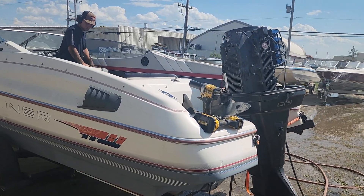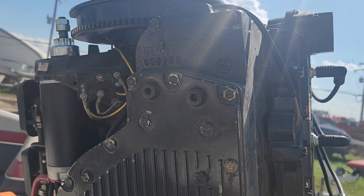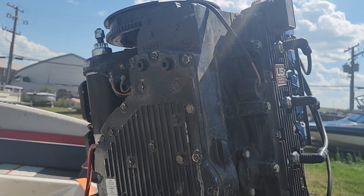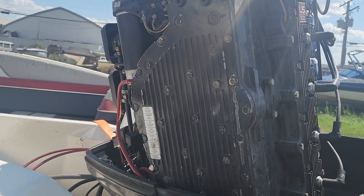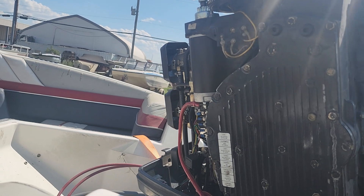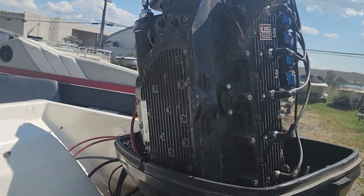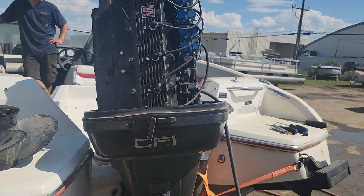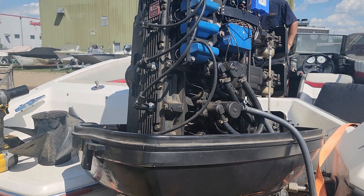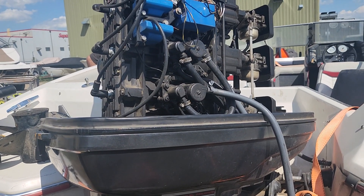One thing we did note when we originally started this engine is that water was leaking out through the top of the exhaust plates, which typically means that someone got it hot over time and those gaskets might have been crushed. With Force engines that's never a good thing because we could now be introducing water into the engine, and that could be causing the issue. We don't appear to have any fuel problems — we hit the primer to throw more fuel at it while at high speed and the RPM doesn't pick up, so it's not starving for fuel. The electronics all work, and we did a cylinder drop test on all five cylinders — they're all working properly. We just ran new fuel through, so everything should be good as far as that goes.